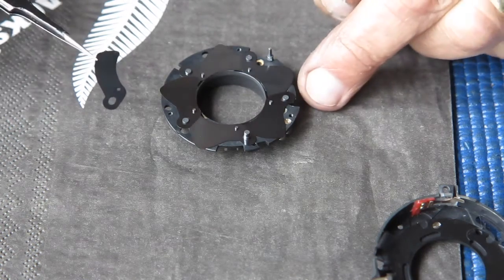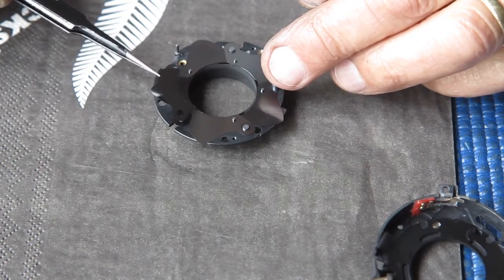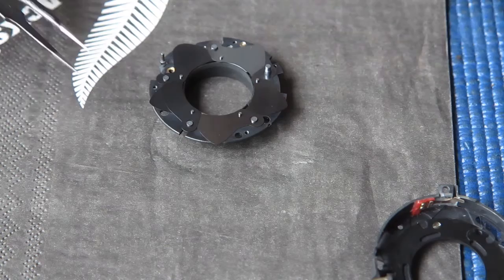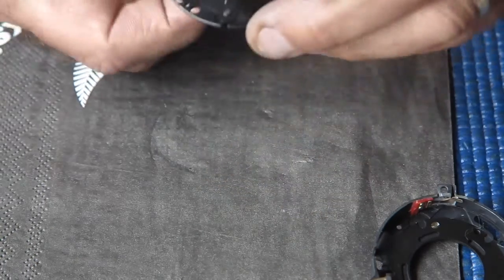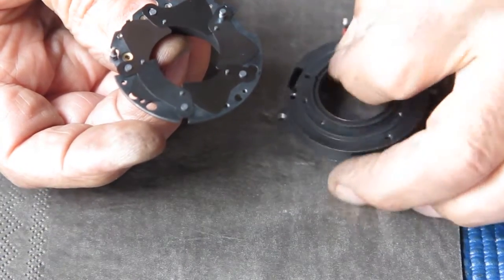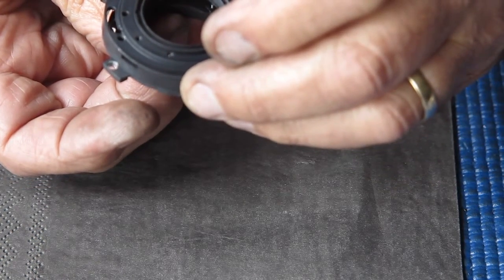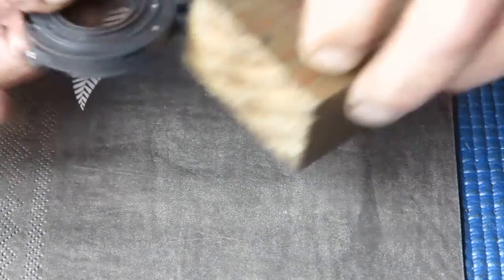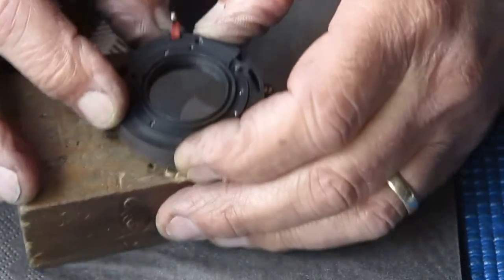And the final blade is a cover blade. And goes over the first blade position. That's good. Now I'm just going to close those blades very slightly. And fit the case, the shutter case, back over the top. And you hope to do that without disturbing anything. I'm holding this case together here at the moment.